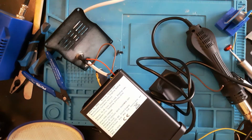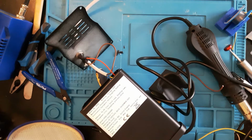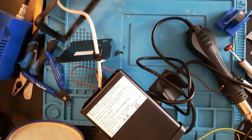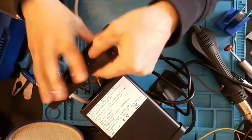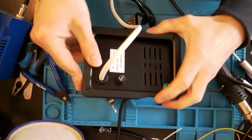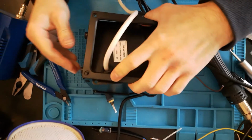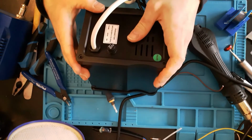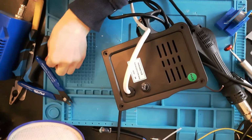Find the cable. Oh my god, I made this wire really long. It's about 1.5 meters or 2 meters, something like that. Only about half a meter when I bought it. But that should be fine, it doesn't use 13 amps anyway. You get away with 6 amp wire, as long as it has an earth in it. You don't need fully rated cable, but I have fully rated cable because I'm just that sort of guy. And I just have loads of it kicking about, so I might as well use the stuff I have loads of. Alright, put these back in.